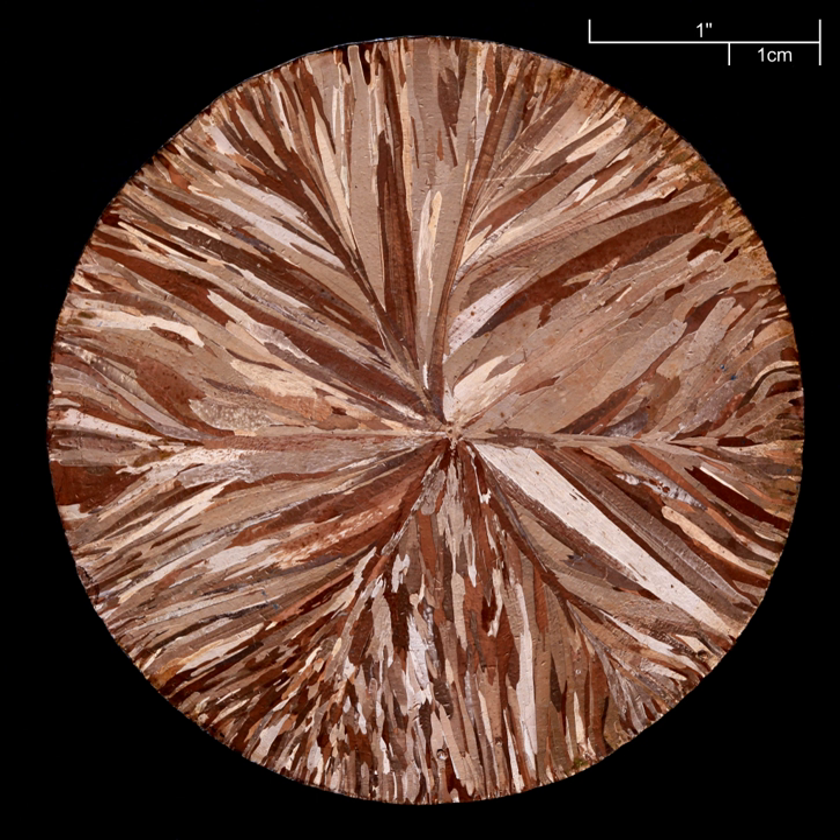A small sample of the material to be cut, of the same material specification, heat treatment condition, and approximately the same thickness, is etched for a certain time. After this time, the depth of the etch is measured and used with the time to calculate the etch rate. Aluminium is commonly etched at rates around 0.178 cm/h, and magnesium about 0.46 cm/h.